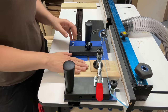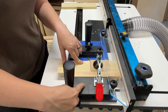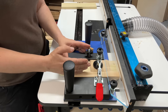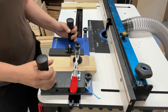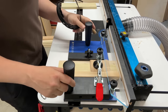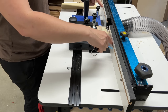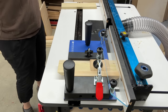Now the piece is secure — held downward by the clamp, against the sacrificial piece of wood that's screwed through, and sandwiched tightly by the other piece. It's held in place by three points: from this side, that side, and downward pressure. Now we're ready to make our cut. I'll turn on my dust extractor and push the sled against the fence the whole time, moving it slowly across. Even at the point where there's no fence contact, the clear plastic base rides against the fence, so the jig moves straight and I should get a very clean miter.